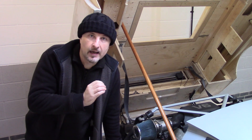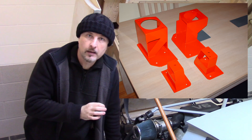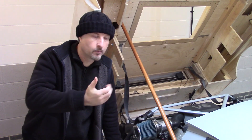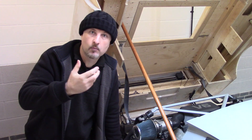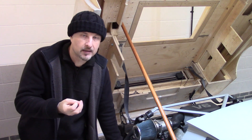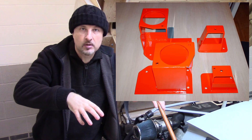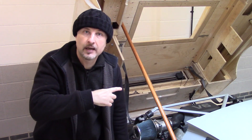One of the things I had to figure out were the engine mounts. To make this modular, I couldn't weld the engine mounts into the chassis, because if any of you wanted to build this car, you'd have to hack into the chassis, cut out the old mounts and then weld in your own. So I came up with an idea of having a base plate built into the chassis — mounts which would be changeable would bolt to that, and then the engine would bolt onto the mounts.